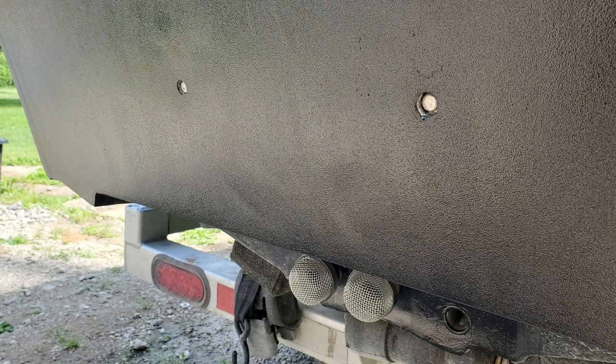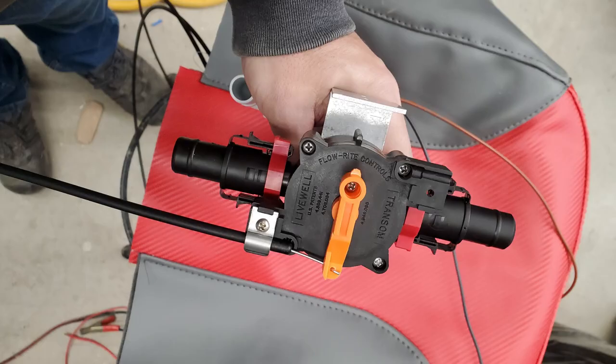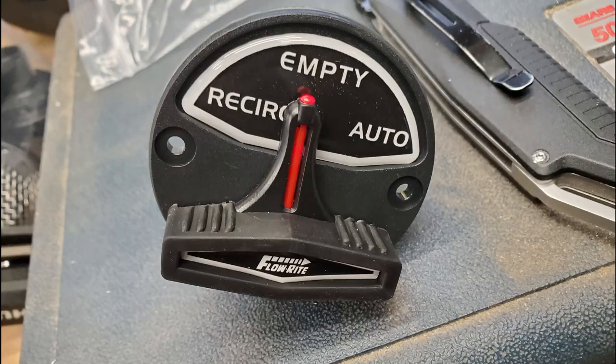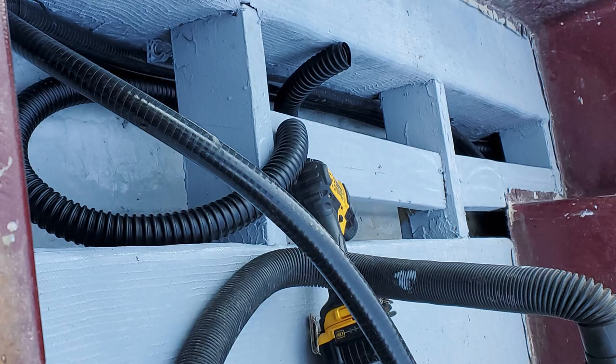The pickups for the livewell pumps were installed, attached to the pumps using convenient quick-connect fittings so you don't need to hang upside down and screw around with tightening worm gear clamps. The valves are remotely controlled at the helm to fill, recirculate, or empty out the livewells. The bilge and through-hole fittings all use similar hose and quick connectors. Up under the mid-deck, I also ran drain tubing for recessed cockpit drains that empty into the aft bilge.